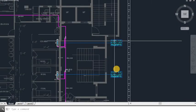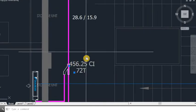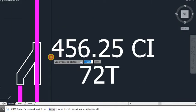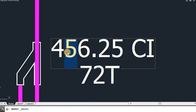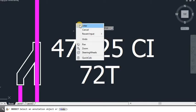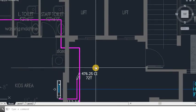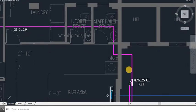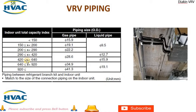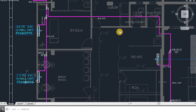The next unit is also a 0.6 TR high wall with CI = 20. Adding 20 more gives approximately 476.25. The T-joint will be 72. From this refnet to the next, the total is still below 640, so the pipe size remains 28.6 and 15.9.